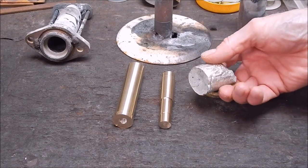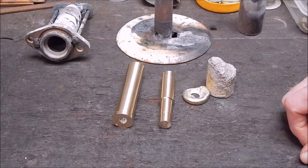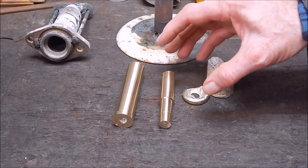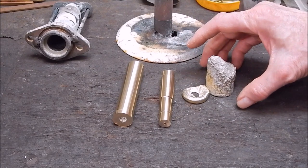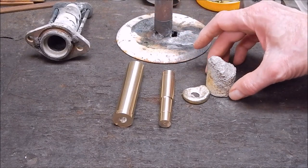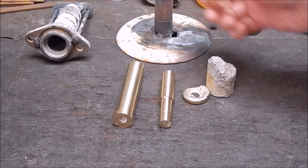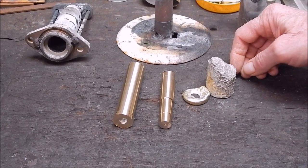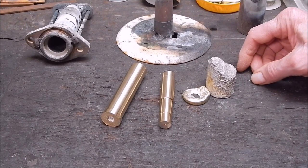We've got these leftover bits as well — just melt them down and good to go. It's not difficult, just a few little things to be aware of. The trick is get the brass as hot as possible — I had that crucible glowing red hot. Get it absolutely as molten and runny as you can and you won't get any imperfections. Preheat your moulds, but don't overheat them. If they get red hot you may have trouble getting the brass out — normally it comes out pretty easy but I overdid it and had to belt away at it. Alright, that's it for me. Not much else to say. See you next time. Cheers.